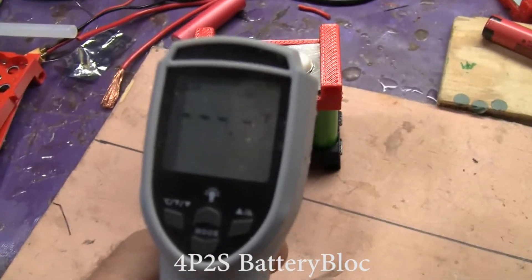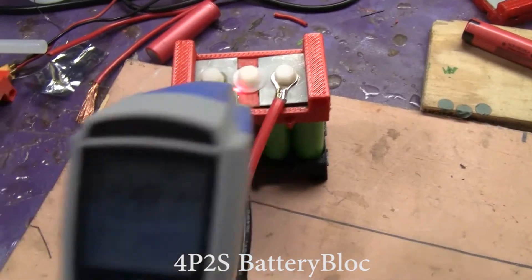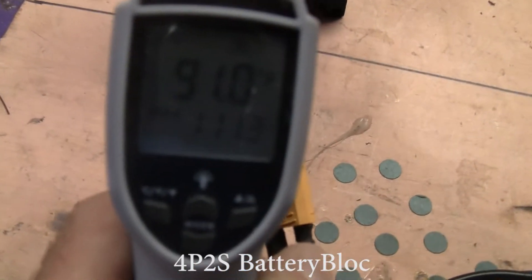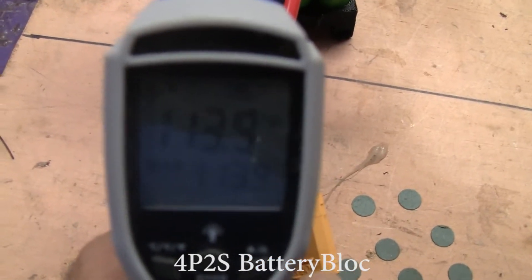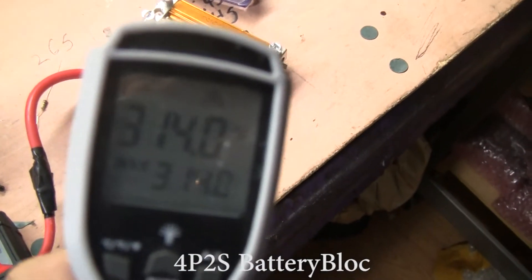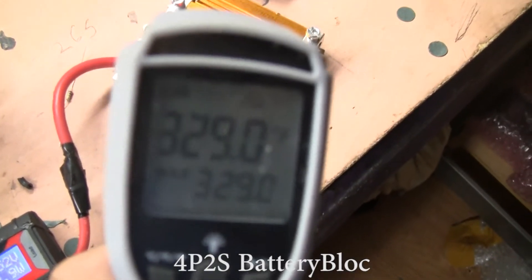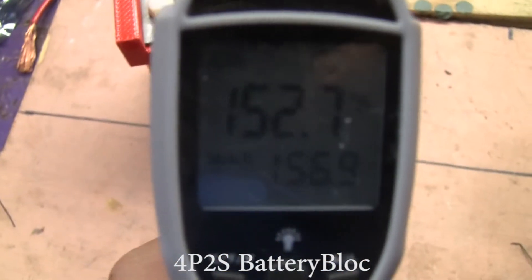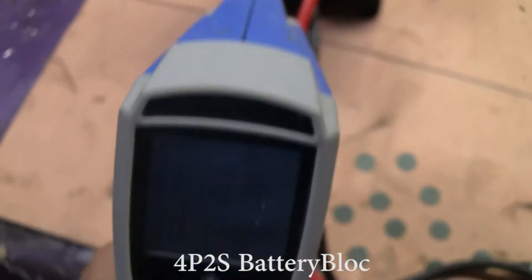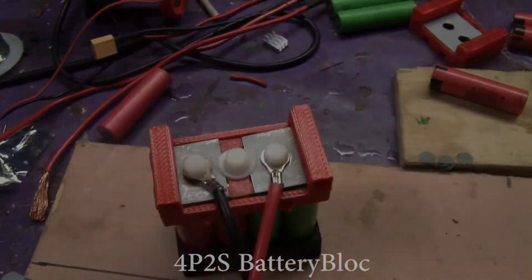Let's check the temperatures — this is going to be hot. Yep, 135, 130, at the cells. 102, 115, and the resistors are at 315 — I'm smelling them over here, they're making a nice burning smell. This is a lot of power to be flowing. The battery block is handling it well. It's 152 degrees. The cells are 142, so most of the heat is coming from the cells. I'm going to disconnect it — this is a lot of surging to be going on.